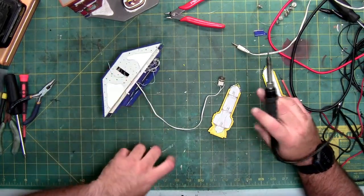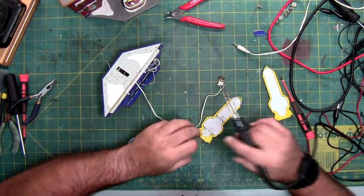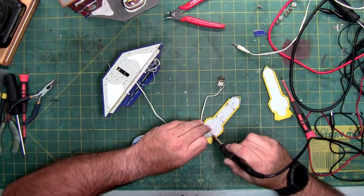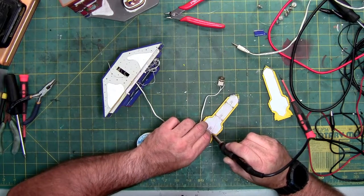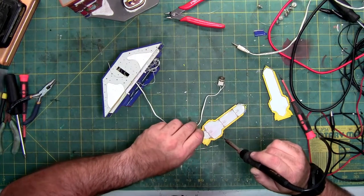Now, whenever you're soldering, especially on something old, it's good to re-solder. I mentioned it in multiple videos, because it allows the new solder to soak into the old solder and also allows heat transfer. So I can now use this to hopefully desolder this wire.